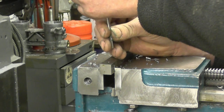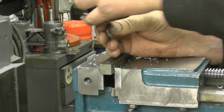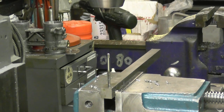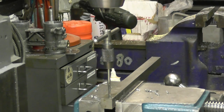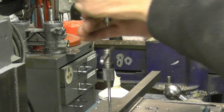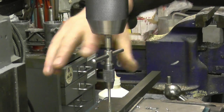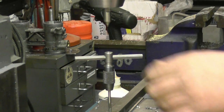I'm going to drill it in there for 4mm — the tap will be easy to break if you're not careful. I don't want to drill it off straight. Once it's started, I'm just going to put a center there just to hold it. Just put a little bit of weight on by hand — just keeps the tap nice and straight. This is actually case steel we're using; it's quite a different material.